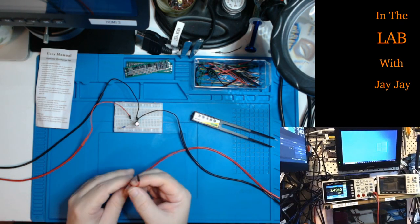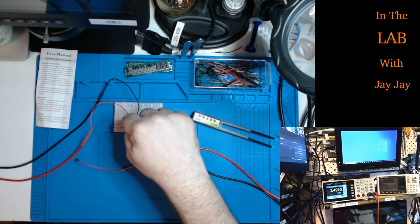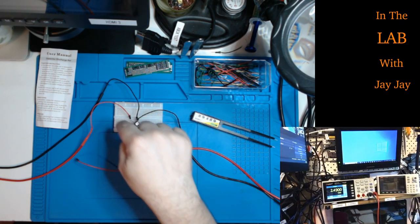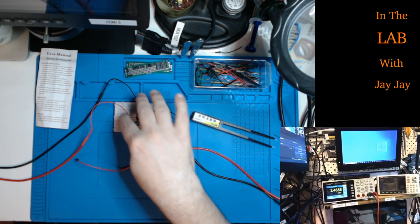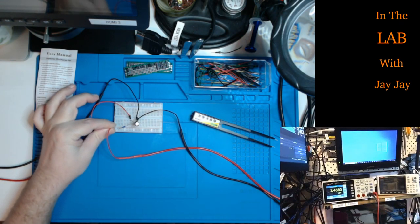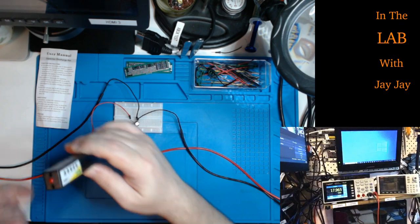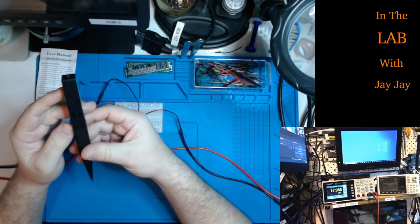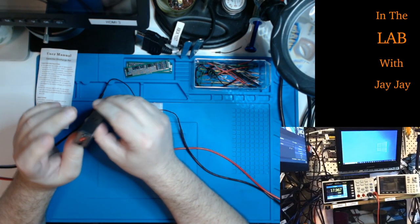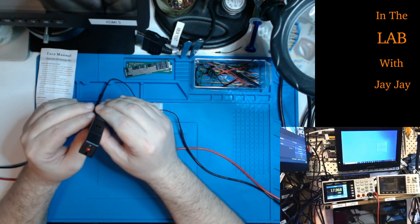We've got our positive 18 volts running into a 1K resistor, running into the capacitor. The capacitor's running this way out to the multimeter. So let's power this guy up. And the capacitor's charged, so we should see that jump up to 18 volts. There it is. Okay.